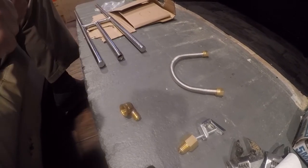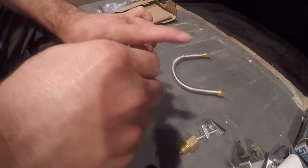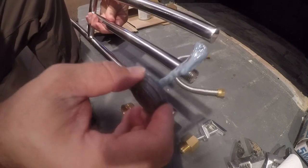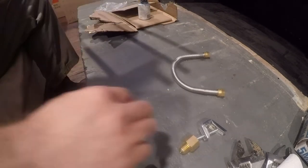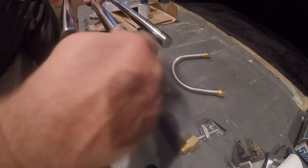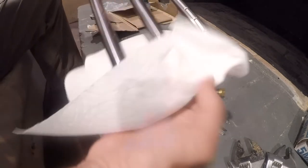The first thing you need to do is figure out what fittings you're going to use. Sometimes this stuff's hard to open — it's always a good idea to stir it a little bit. You just put this on here. You can use Teflon tape if you want; I just don't like it. I think the Teflon paste is a better product, so it's what I like to use. Then I like to wipe off the excess.